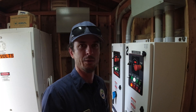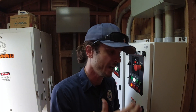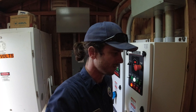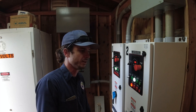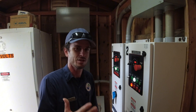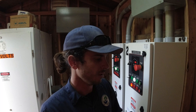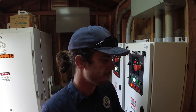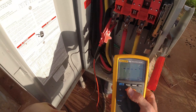We're going to meg it anyway just to be sure, then put it back in auto. If it trips again I'm taking it out of service - this is getting to be too much and we need one working. We'll pop this motor with a thousand volts for the meg test. It's a 480V motor, so it can handle that.